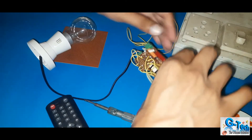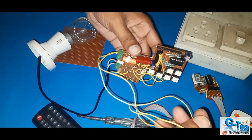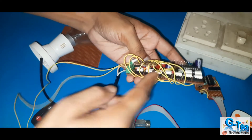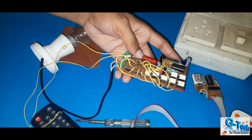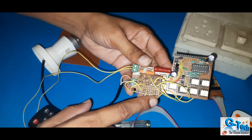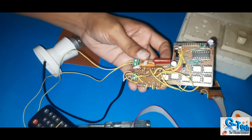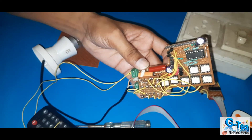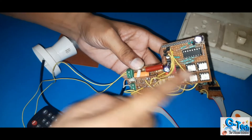I am using two terminals here — one is for the main supply, 220V supply. I am using this circuit board, this is the main voltage regulator. If you need this circuit, you can see my other project — the link is already given in the comment box, you will get this circuit from that link. This is the power supply: I am using a ceramic capacitor, one resistance, and one electrolytic capacitor to make a power supply to operate this circuit board.